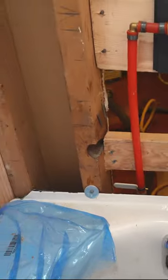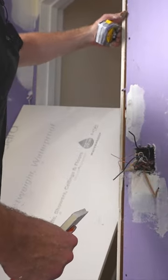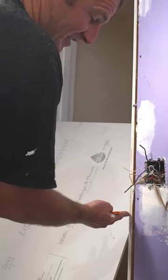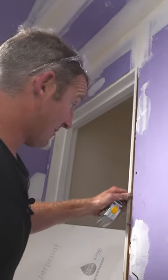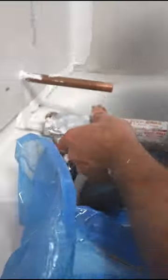The main reason I didn't want to fur this out is because you would need extension jambs for your trim, and that's usually a really bad idea — especially on the inside of a door — because your door latch will hit the extension jamb and it will always take the paint off of it. So it's a really good idea to prevent having any type of extension jamb on the inside of your doors.